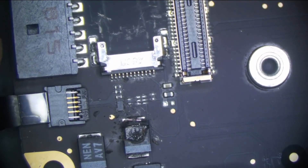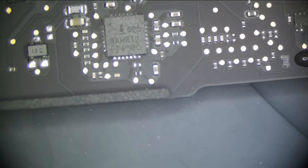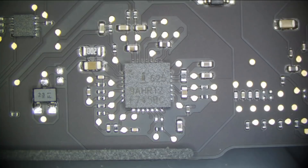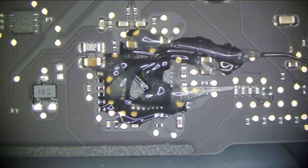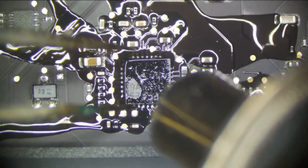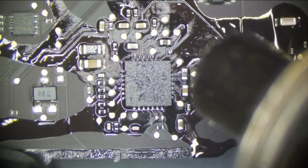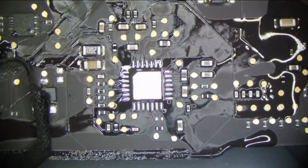We're going to take off our fan first, then we're going to change our ISL. Our ISL is right here — notice it looks perfectly fine; we couldn't tell that it's damaged just by looking at it. So we're going to go ahead and replace it. I'm going to turn on my hot air station and get a little bit of flux around it. Kicking on our fume extractor so I can continue fixing boards long into the future without getting some form of lung disease. Kicking on our hot air — hold the ISL off.